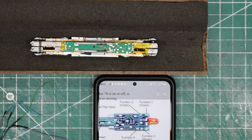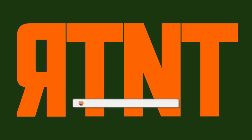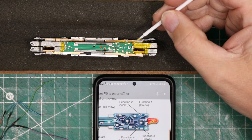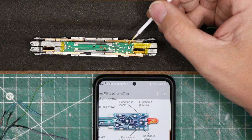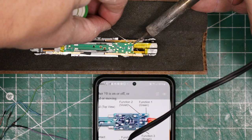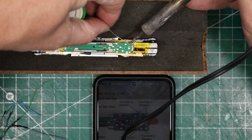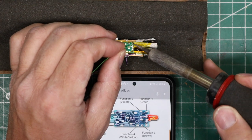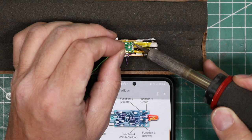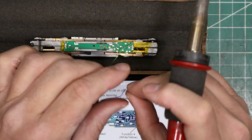Before I go any further, if you find this video helpful and would like to see more model railroad tips, tools, and techniques, be sure to subscribe and click the little bell icon so you can catch future videos. I used an extra fine micro brush to apply just a tiny drop of flux to each soldering pad that I would be using. I then touched the soldering wire to the pad and applied some heat for just a couple seconds to tin the pad. For fine electronics like this, I use a very small soldering wire — 3 tenths of a millimeter. The wires were already tinned from being installed on the old board. I then touched the wires to the pads, applied heat until the solder liquefied, then removed the heat and held it in place very still for a couple seconds until it solidified.